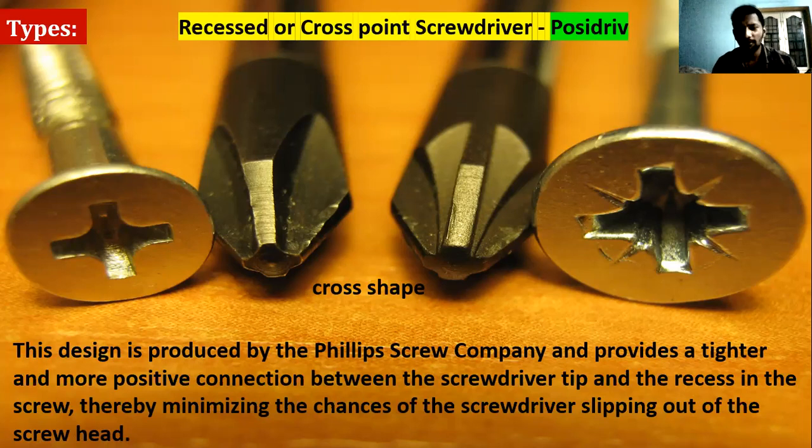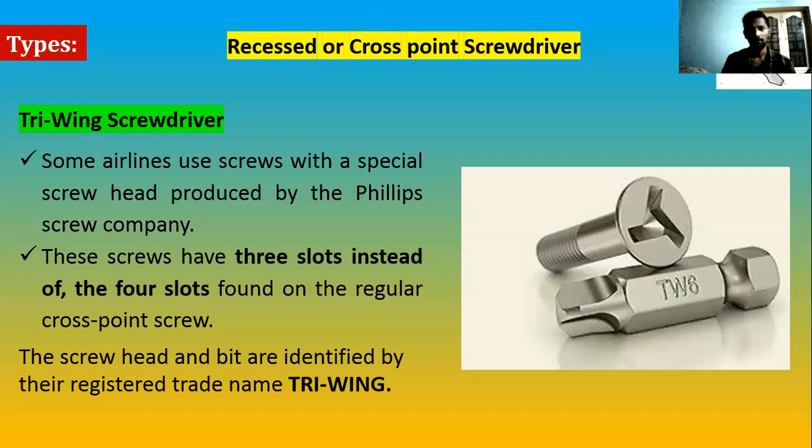The reason for two different designs: if you're using a Phillips to remove a large number of screws, the automatic cam-out can cause damage to the screw head. In aviation, it is very critical — we don't want to apply too little or too much torque to a particular screw or bolt. That's why Pozidriv was designed: it gives exactly the right amount of torque. You must still not over-torque — that is a separate category.